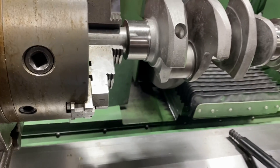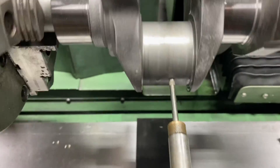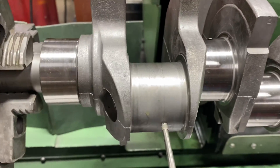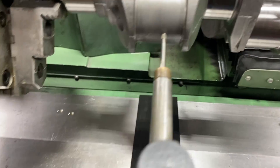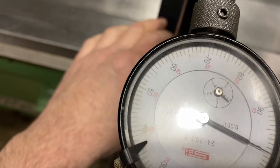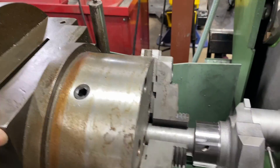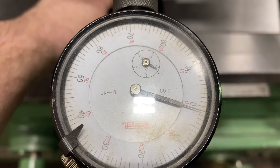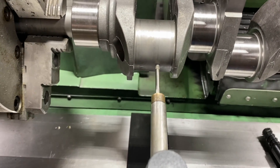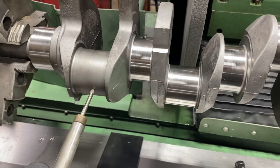Let's check our indexing here. There are two things in play: you've got the actual stroke of the crankshaft - right here, 90 degrees - that's the top of the journal, that's my stroke. This should not have changed because I've got the chuck set up from the previous three journals. My indicator is already on zero. Let's rotate this 180 degrees and look at the bottom of the journal. I'm positive one - one thousandths off on the stroke, that's nothing. Technically this crank will have one thousandths less stroke on this hole, but what we do is split the difference across the crank so everything grinds close to the same.